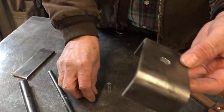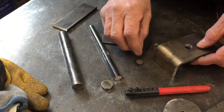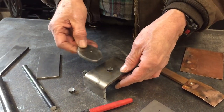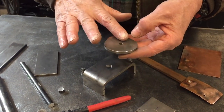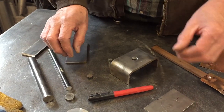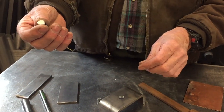You don't have to spend a lot of cleanup time on the inside because no one's going to see it — it's covered up. That's how I plug holes most of the time. You can get this rod in all different sizes; this one is three-quarter inch. And if you have a ginormous hole, this is the center section from a hole saw — same idea: fit it into the hole, tack it, use magnets to hold it in place, grind it down, and that big hole is totally gone. Using the rod is way easier than trying to trace a circle and grind it out. This is the shortcut — it works awesome.